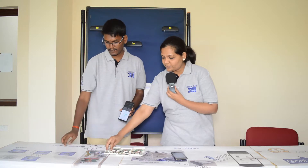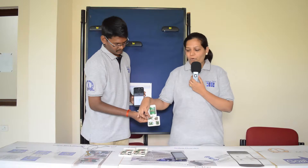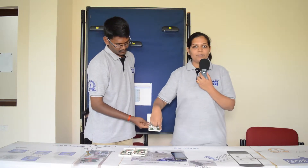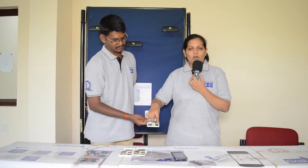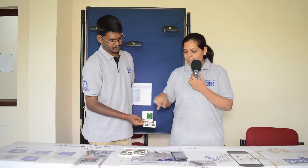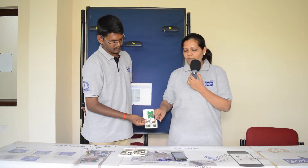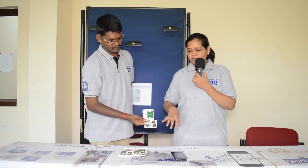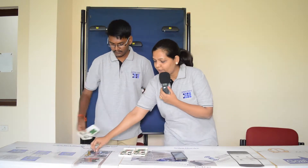In this architecture we have the NRF52832 board, the gateway board, and the piezo sensor board. Depending on what type of sensor you are using, the sensor board will change, but the rest remains the same. This is a CR2032 220mAh 3V battery, which is sufficient to power the whole system and, depending on the sensor used, will last up to 10 years of lifetime.